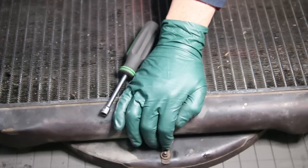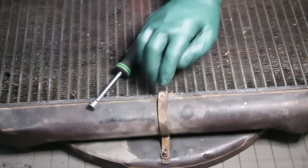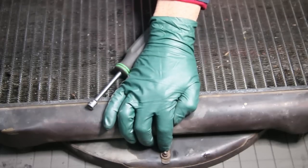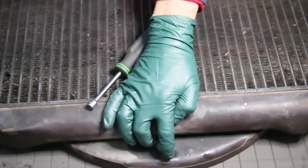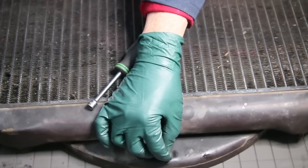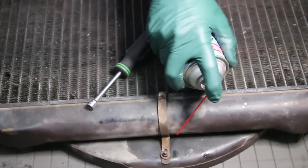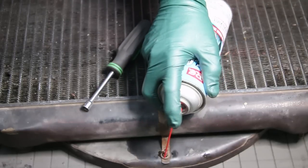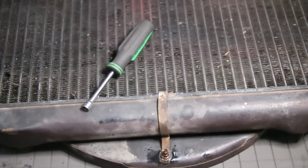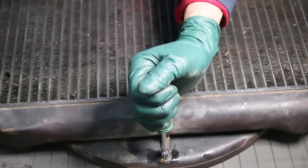This is a stud, a welded stud, and a nut — so there's no way to get anything held on the back side. This is a brace strap for the top of the shroud. Look at how rusty these threads are. If they were severely rusty, I would take a little wire brush on a drill or on a Dremel and try to clean the threads up a little bit. This doesn't look too bad, but I'm going to be careful. I'm going to spray that a little bit and let it soak. Once again, I'm going to use this nut driver so I don't overstress it.